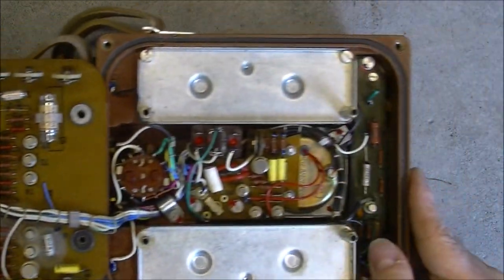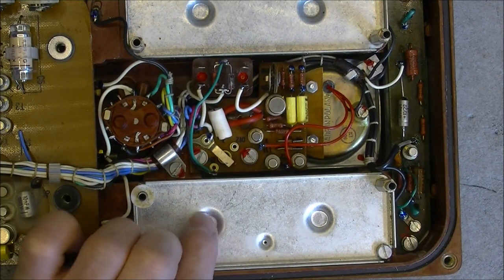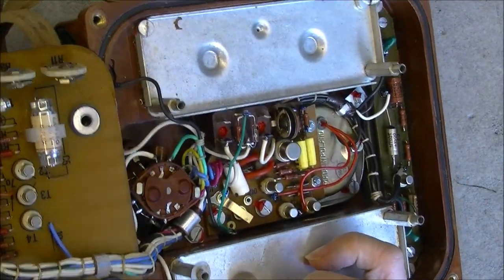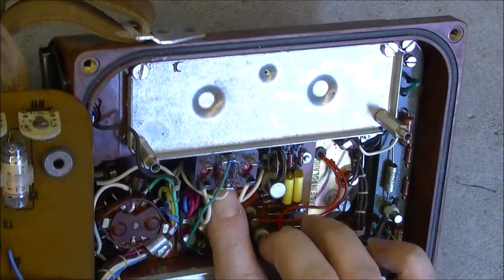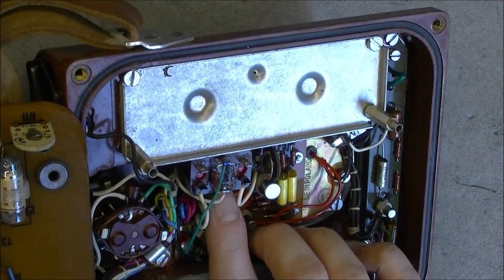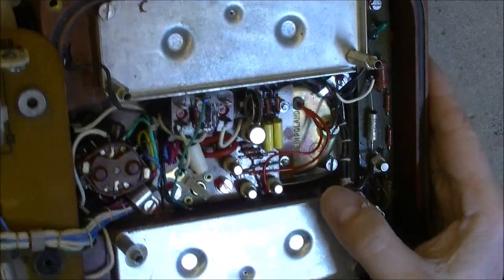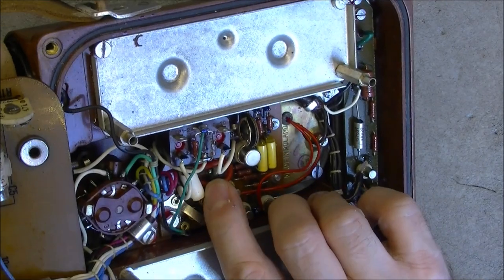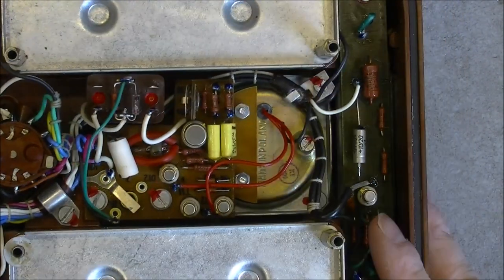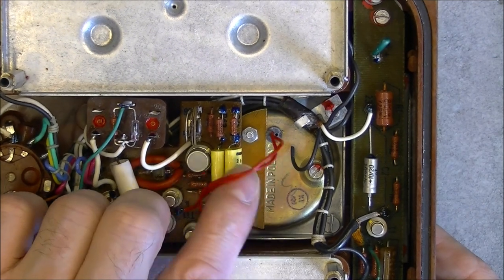Here is what we have inside. The metal plates are just for covering the battery compartments. We have the function selector switch - same very Soviet design. Also this button to select between speaker and light, but it is actually written not in Cyrillic characters - it seems to be of Soviet design but with non-Cyrillic characters, which is interesting. There is a little board here, and in here we have the neon bulb. Very regular film capacitors, and the speaker or buzzer is obviously written 'made in Poland'.